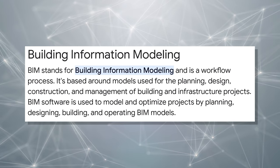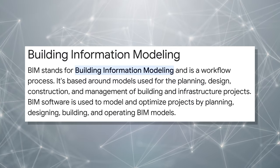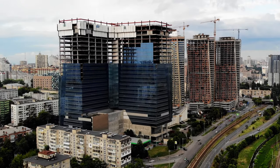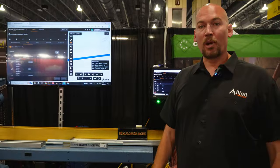Next up, I thought was really cool was Allied BIM. BIM is something that a lot of people are using nowadays - it's Building Information Modeling. You can take a set of plans and figure out a model of what a building is going to need. It's a great way to pre-configure every single conduit run, the lengths of all your wires, everything. This is usually used on skyscrapers and huge buildings where you need all of this information managed so you know your materials very accurately. What I think is cool about this is they have a way to mark the conduit and print what each piece of the whole production line is going to be right on the conduit, including any of your bends and offset stuff.